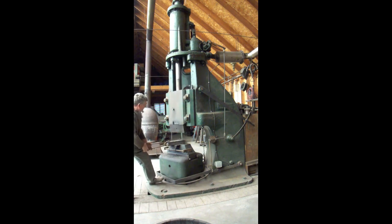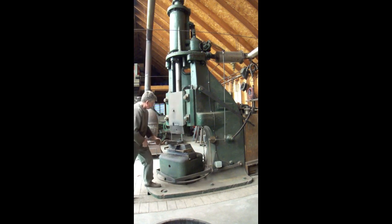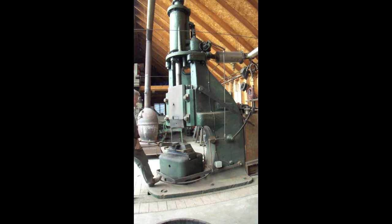You can control how hard you want to hit. You can lift up on the treadle and then back right off — it'll shut down. Hit the treadle again and it'll stay up. Drop the treadle and it'll slowly come back. Hit the treadle with a little more pressure and it'll sit there and cycle.